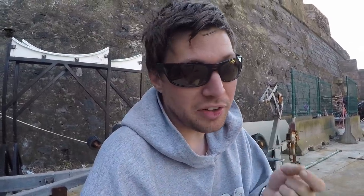Alright, we got all the legs cut. You're probably wondering why I was using a hacksaw instead of a wood saw to cut wood — the answer is really simple: mahogany is more like metal than it is like wood. I can't cut it with a hand saw, it just won't go. With a hacksaw it's still a lot of work — it's like cutting through stainless. The other benefit of a hacksaw is the much smaller kerf and teeth closer together, giving a much finer, smoother cut. To mount it to the deck, I'm going to cut strips that will screw into the base of the foot and then lag bolt into the deck.